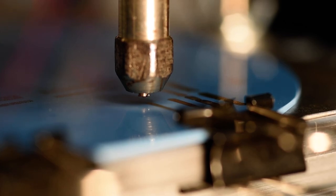This is test number two of 1.6 millimeter wire — 1.6 millimeter diameter copper wire being deposited on high polished as-fired DuPont 951 LTCC at 30,000 rpm and at a surface feed rate of 75 millimeters per minute.